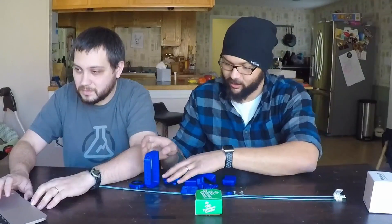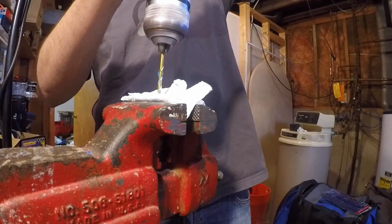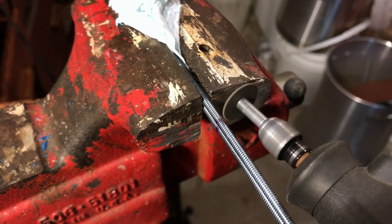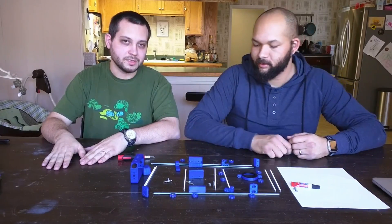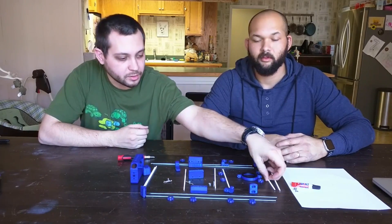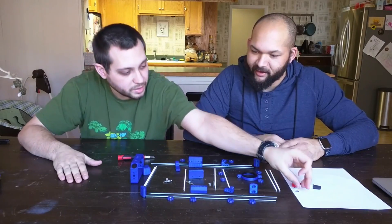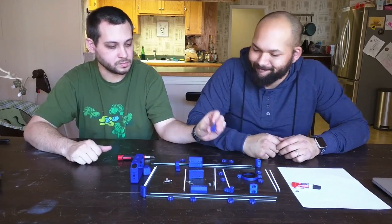Let's organize the parts. Alright, so this goes here. One down. We got our missing rods. Everything is sort of loosely assembled here. We kind of fudged it a little bit because this thing was designed for an M3 style rod, and our local Ace does not have that. So we went with 6-32 size — but it'll be okay, it'll work out. We had to drill some of the holes out of the middle, where it's going to thread through, but it shouldn't be a big issue.